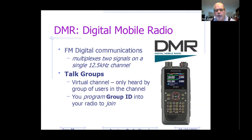How do we share those two signals? Well, they're shared on virtual channels. In other words, the A channel and the B channel can be broken up into talk groups. One example in this area is you can have a talk group that's South Jersey. You can have a talk group that's North America. You can have a talk group that's the tri-state talk group. You program your radio for that particular group ID in order to join any one particular group.